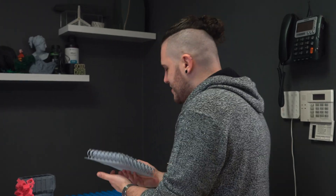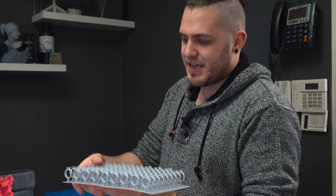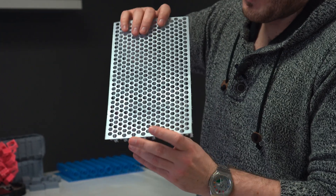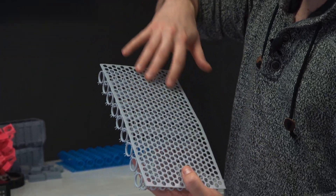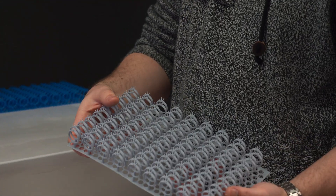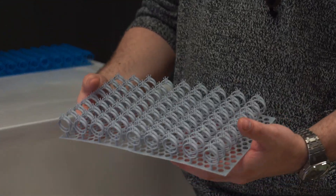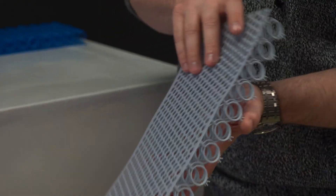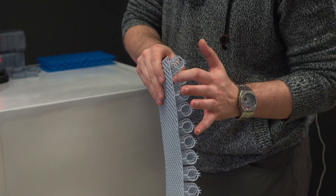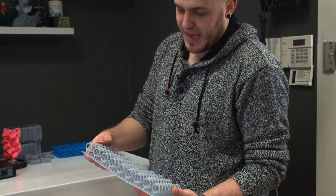This was actually the first test print I did on the Forge — obviously it's a pile of rings. I put them on a hexagonal raft specifically so I could show what's going on and have it all hold together. In the real world you would not want a raft — you'd just put little sprues directly on the build plate, and after that you'd scrape them all off, wash, sprue, and cast.